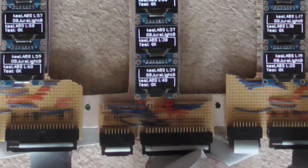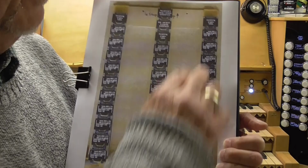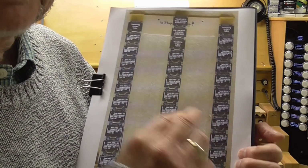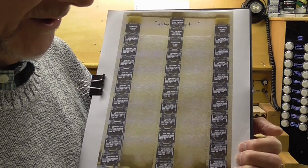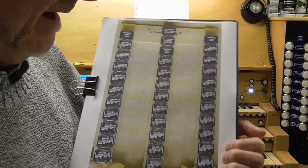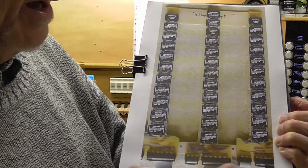The 16-way carries the control signals and data signals to each of these legs of the structure, and they connect to all the OLEDs and deliver the textual data, obviously in digital form, and the appropriate OLED responds to its own message by the way that the electronics works. And the rest of the connections here are to the many pins on the Due, which ensure that it can all be coordinated. Unfortunately, the Arduino Due is not shown on this picture. That's a pity, but there we are.